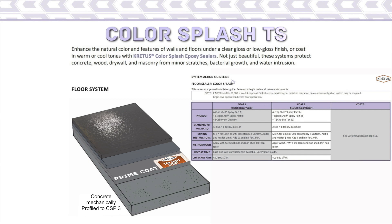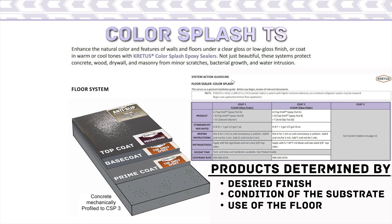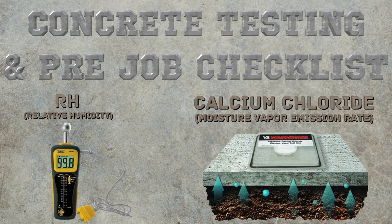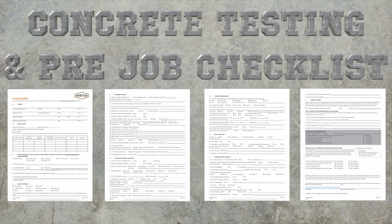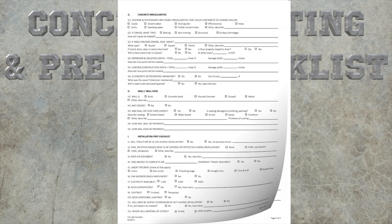For this system, the prime and base coats are Top Shelf Epoxy. The top coat is Polyurethane HS mixed with Anti-Slip TEX50. The system and applications you choose for the prime, base, and top coat are determined by the desired finish, the condition of the substrate, the use of the floor, and the applicator's skill level. Before you select any CRETA's system or product, conduct moisture emission and humidity tests on the concrete, then fill out your pre-job checklist. This will help you determine the right CRETA's products to use in the system.